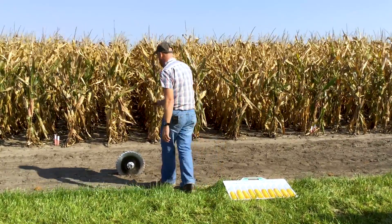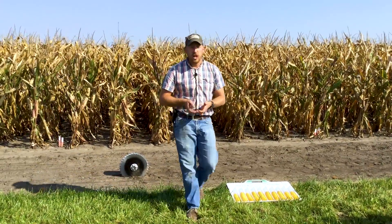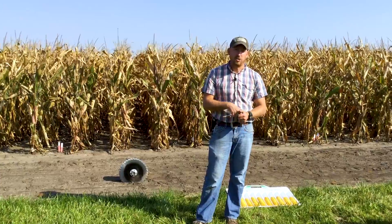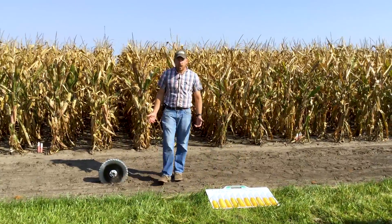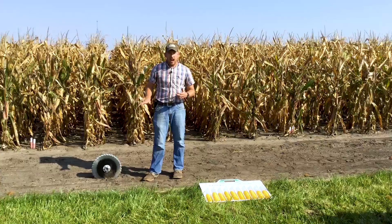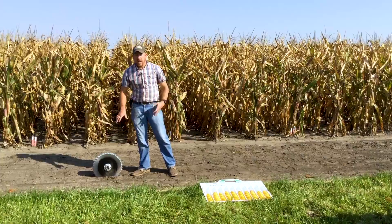The other thing they do is a little bit of tillage, but they also increase the width at the bottom of that seed trench — more of a U-shape seed trench versus a V. That U-shape allows more room to get that seed down to the bottom of the trench and increases seed-to-soil contact. I see these openers working well in no-till and cover crops where it might take more pressure to keep that row unit in the ground and engaged. The bearing is going to last a lot longer than a standard opener bearing in those situations.